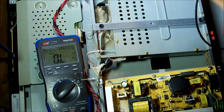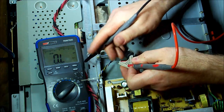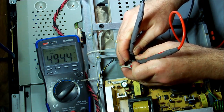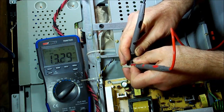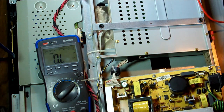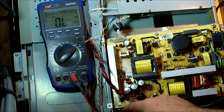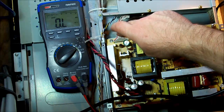Just double-checked — that pin is not ground. So we'll start again: a fifth pin along, one, two, three, four, five. Third and fourth need longer leads. Third looks like normal input capacitance, and fourth looks about the same. Now, this is the backlight connector and this is for the other side of the screen. When I turned it on and it was making the chirping noise, I checked the voltage on here and it was a steady 12 volts, so I don't believe this side is loading it up.